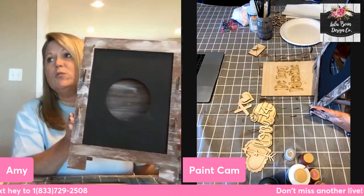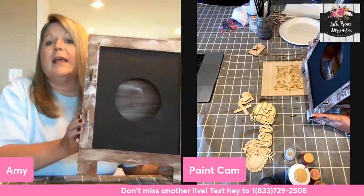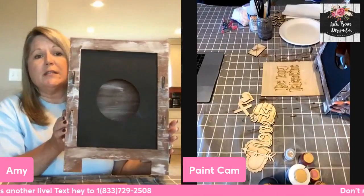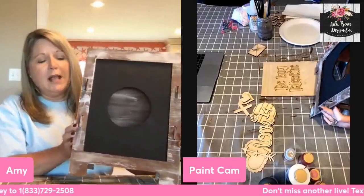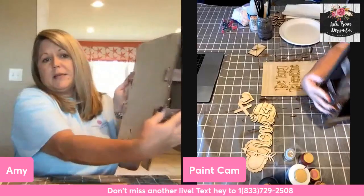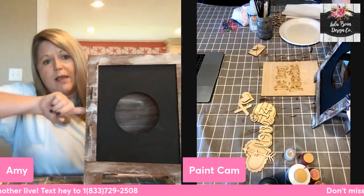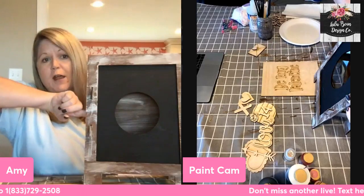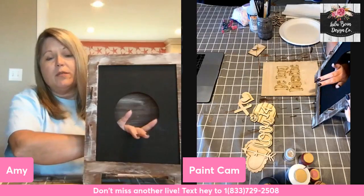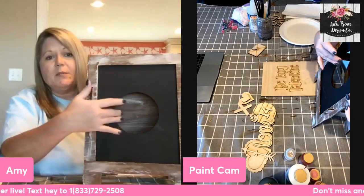So it's going to take you 3 sheets of Glowforge size wood to cut the initial easel or sandwich board. It'll take 3 sheets to cut this initially, because you're going to have to cut the front frame, the back solid piece, and then this piece in here, if you can tell, is a separate layer that gets glued on the back of this front frame. And the reason it has a hole is so you can just reach your hand up in here and pop out the interchangeable signs. Okay, so that's why it takes 3, because this is going to be an extra one.